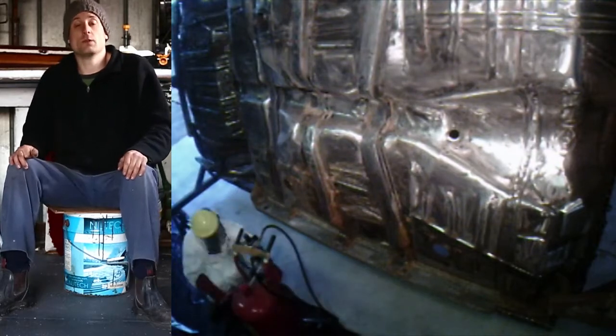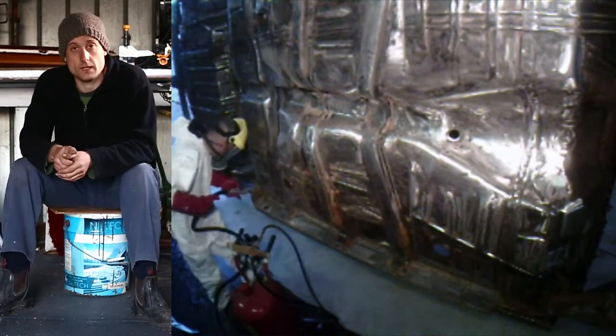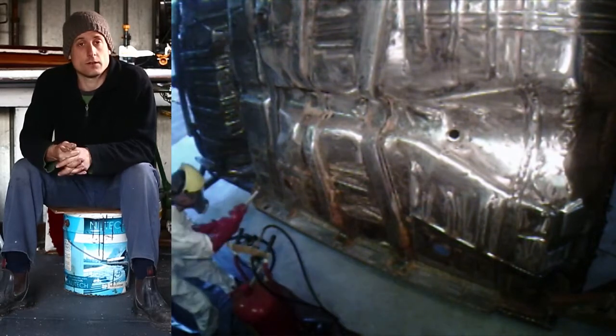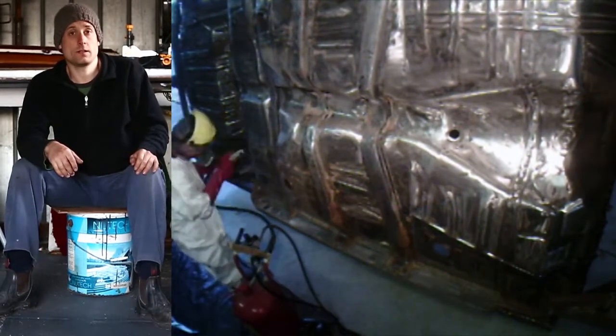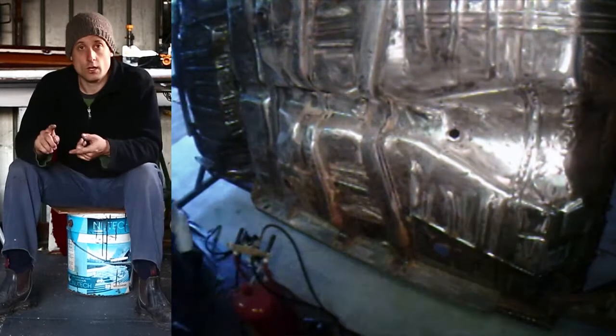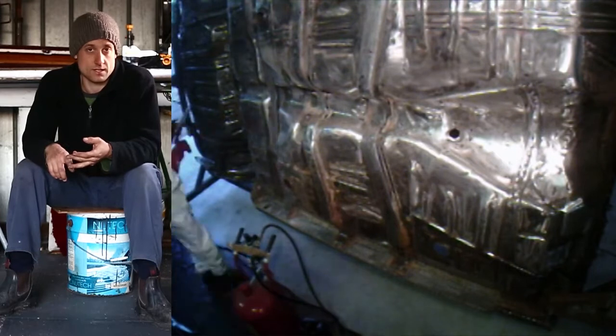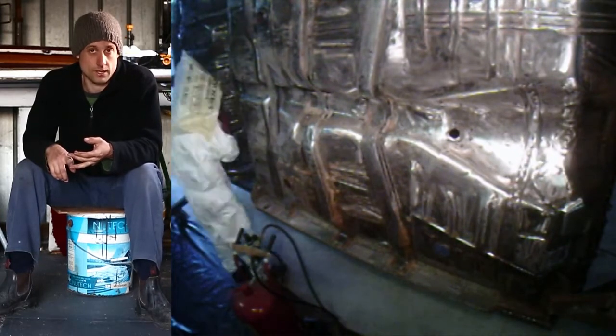I found a place in Melbourne that gave me a really good deal on blasting media. I've got a lot of garnet — I'll tell you where at the end of the video. After I had heaps of media, the limiting factors were my time, the amount of air I could supply, and the amount of ceramic blasting tips I had, and they do wear out fast.